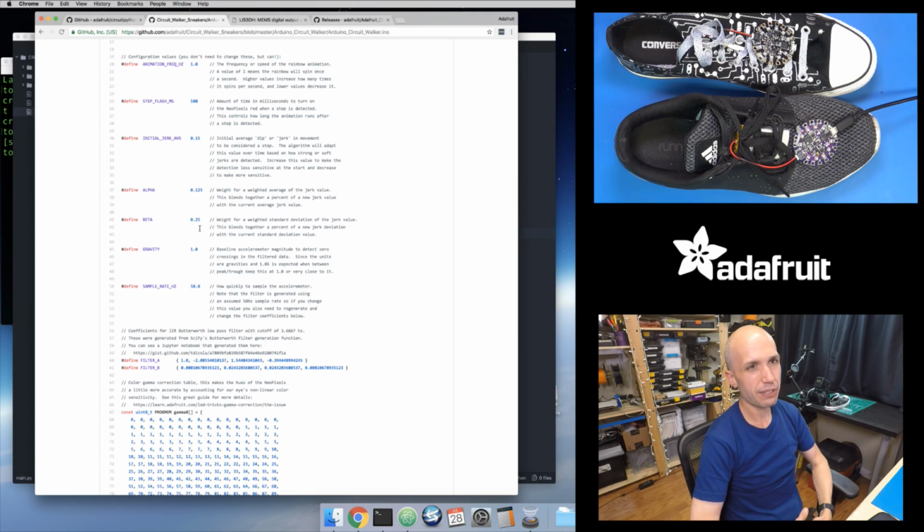And in some earlier testing, I kind of saw what was the fastest I could read, in CircuitPython, the light sensor, for example, and I could only read it maybe 200 times a second, and that's just reading the sensor. That's not actually doing any math on that sensor value. And as soon as I start doing some operations on that, each of those operations has that overhead of having to convert the Python code into the microprocessor code. And so again, that just reduces what you can do.